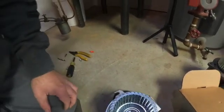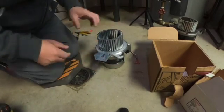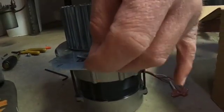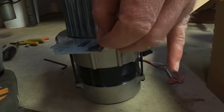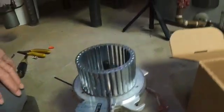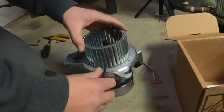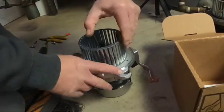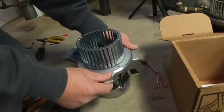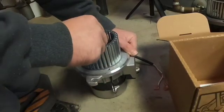It's going to bottom out and then I want to set the gap. I set this right underneath the edge like that, then I get my allen wrench and slide it in through this little hole — it should line up. Move this gauge over, now I can just tighten this up. You don't want to cause stress on the blower wheel, so when you tighten this up just hold the motor and push on the set screw with the allen wrench and tighten up the set screw.